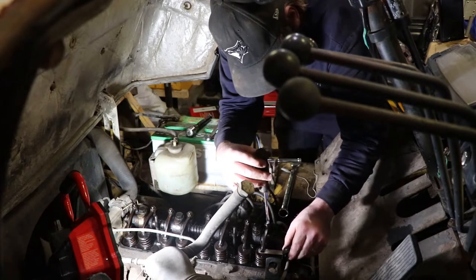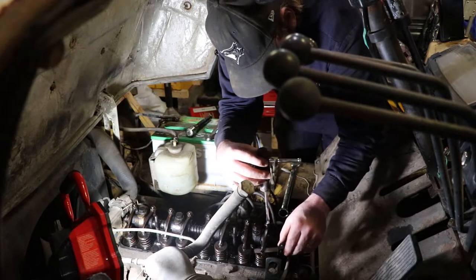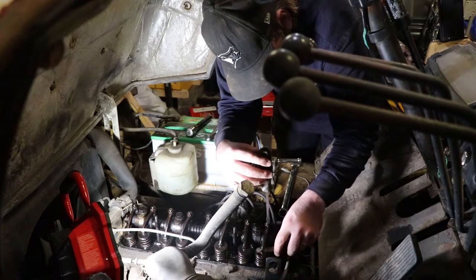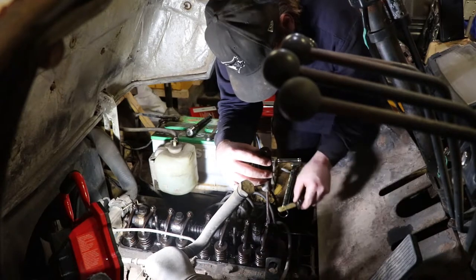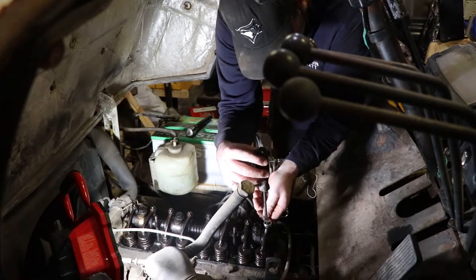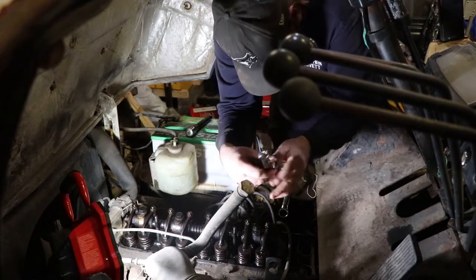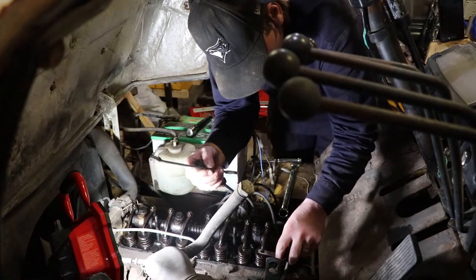So right now it's got a nice amount of drag. Just a tiny little bit more jams it up, so you don't want too much drag - it's a feeler gauge, you're supposed to feel that you're close. Leave it a little bit loose, then put the wrench back on and tighten the jam nut down. That should give me 15 thou when it's set. That's perfect.